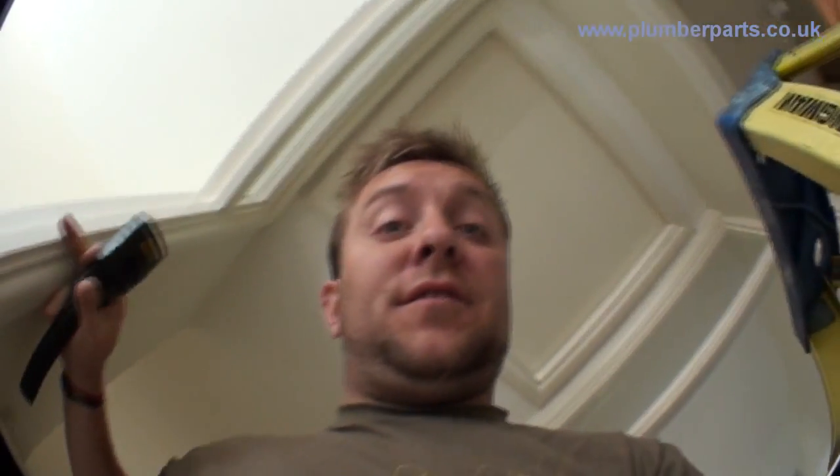For this particular place, we have to go up into the loft. We're up in the loft now — it's very dark. Always watch your footing when you're in a loft. Always make sure you can see the rafters. If you can't, make sure you move any insulation out of the way so you can see.